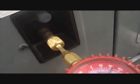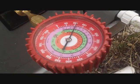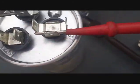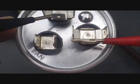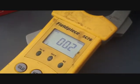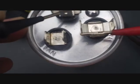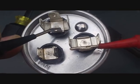As you see, I plugged in my little gauge here just to see if there's refrigerant in there, and there is. So I'm going to go get the capacitor, check it out, and we'll probably swap it out. So you're measuring from Herm to common. It should be 40, and we have nothing. In fact, the fan side was hardly nothing too, but I guess it had just enough juice to get the fan started. But we're going to switch this out, and we should be good.